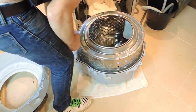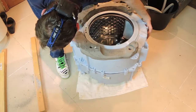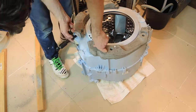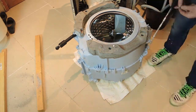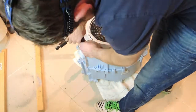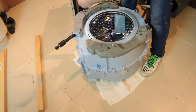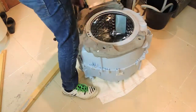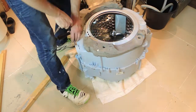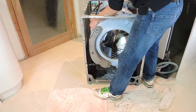That's a new rubber seal going in, and the remaining half goes over. Then you have to screw up all the screws. If you've ever done a cylinder head on a car you'll know to evenly tighten those up — it's kind of what this is. Start at one end, go to the opposite end, then work your way around gently doing each one up a little bit more each time until they're all done up to a nice tight fixing.